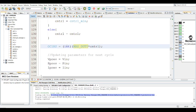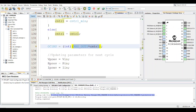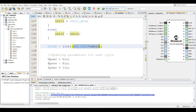And the reason for doing it this way is in the case of taking this from this PIC to another PIC, or potentially an STM. I've come to understand that the Texas has quite an interesting way of doing things. Some of them do not support floating point values, so you sort of have to use a bunch of libraries to do the floating point stuff.